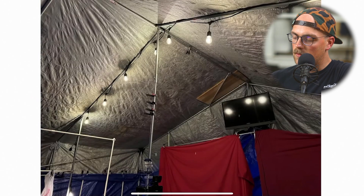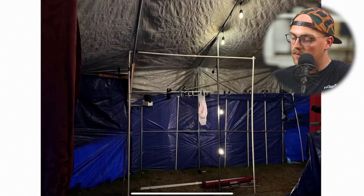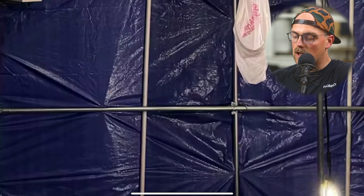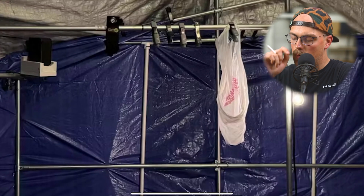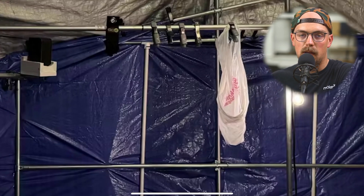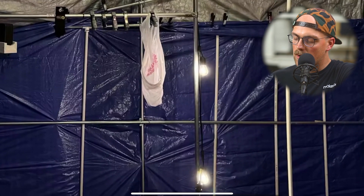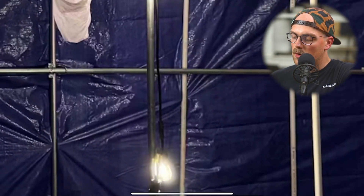There's a lot of different connections — it's a pretty massive structure, similar to what you'd see for a greenhouse. He said he hammered some fiberglass rebar into the ground, then slid PVC over top of that. We can see three-quarter inch EMT running through the top of PVC T connectors, and he used some kind of reducer or shim — probably a piece of PEX — to make that gap work for the three-quarter inch conduit.